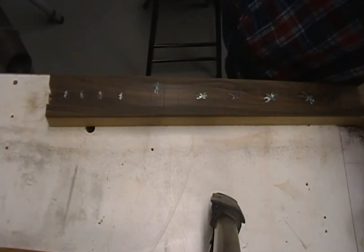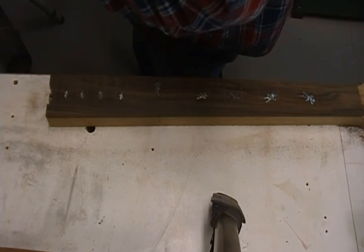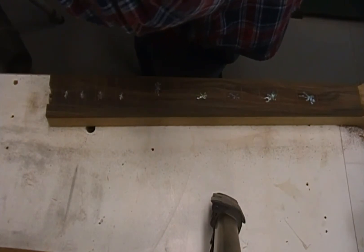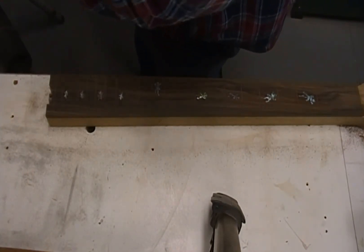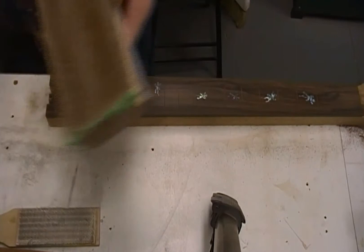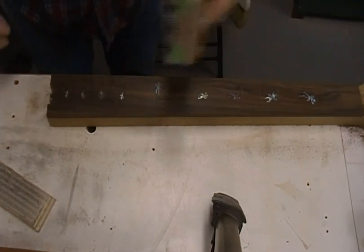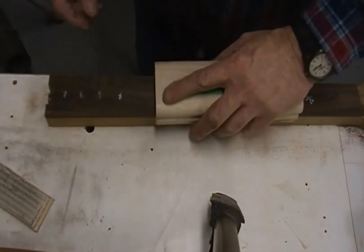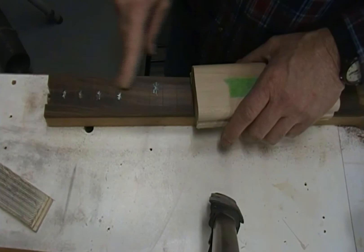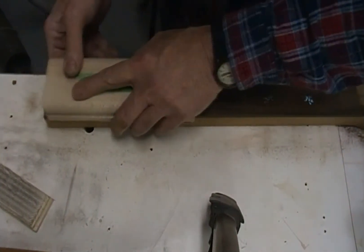I have a piece of 60 grit on here. What's been widely referred to as the masking tape and superglue trick - I've been doing something similar. I only put tape on the block and superglue the paper to it. There's no reason to put masking tape on the paper since that's all going to come off and get thrown away anyway. I'm already a little heavier on this side, so I'm going to turn this around and try to put a little more pressure on this corner.